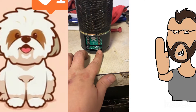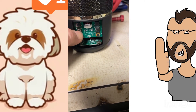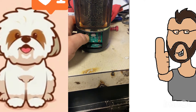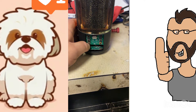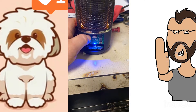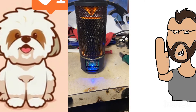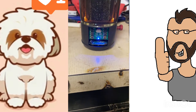The two bottom holes go through the aux and the charging port. Basically pressing these buttons on the outside presses the buttons on the board. We hold the power down — power comes on. This was the volume button, so we hold it and it should beep — there we go, it beeps when it gets to max volume. Now going down with the volume. Before it was just beeping all the time, stuck on, would power on and off whenever it felt like it because of the moisture. There we go — all the way up to max volume again. A little soldering, a little cleaning, and we got this thing operational again.